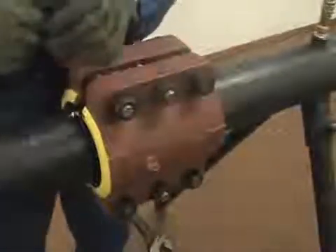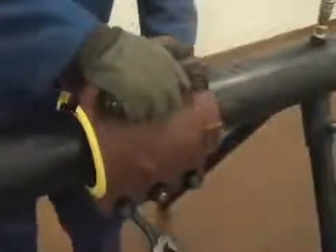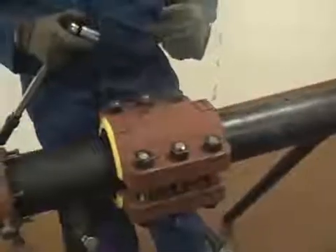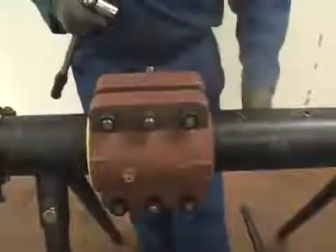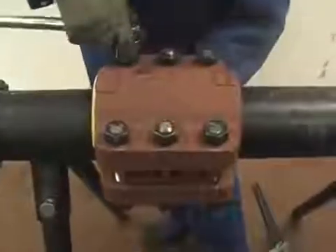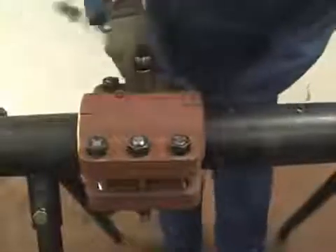Sometimes it's helpful to assemble the sleeve next to the leak and then slide it over the leak. The orientation of the sleeve is not that critical — it can be with the split line vertically or horizontally. Most welders, when installing these and intending to weld them, like the split line to be vertical so the only overhead weld is at the split line on the bottom, with the side seams being horizontal weldments, which are much easier to access. For our purposes today, we're going to rotate and leave the split line horizontally, and I'll begin drawing the bolts down.